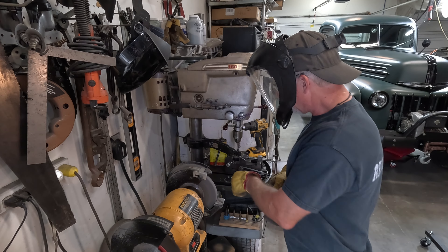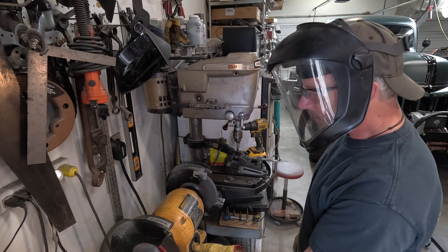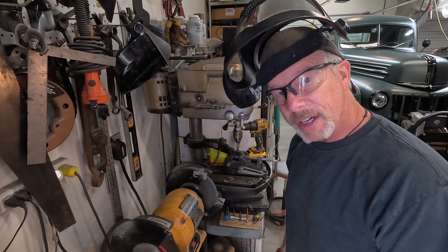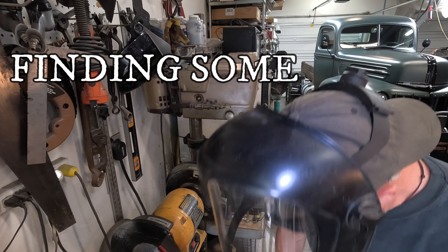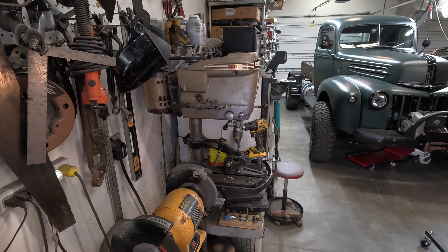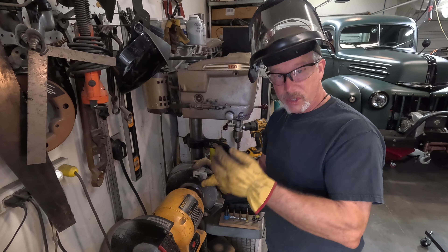One down. The hazard of having a very small piece and not holding on to it hard enough — it's actually in there. That got sucked into this wheel, which is why we wear protection. It's sitting down in the bottom. Thankfully, this wheel has been worn a lot — it doesn't reach all the way to the bottom, so it didn't get kicked all the way around, throw back out, and hit me, which would have been bad.